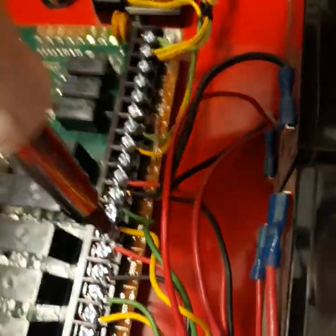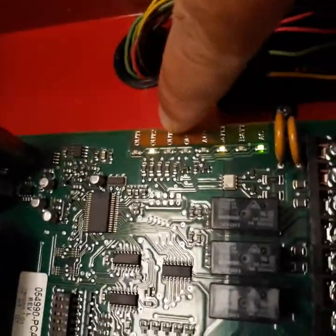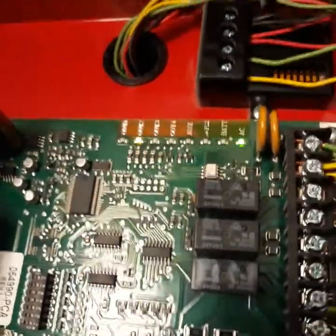I'm going to take these loose and show you where I found it. It's hard to focus because the lights are harsh in here. I'll take that loose — the fault is still there, and it also kicked output number two fault because it's reading the open. Now watch what happens as soon as I take this leg off — it all goes away.